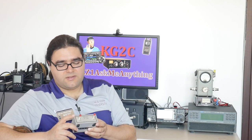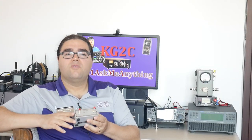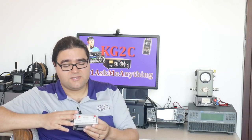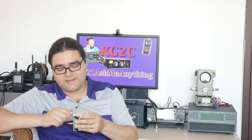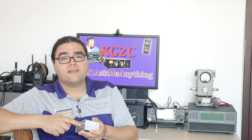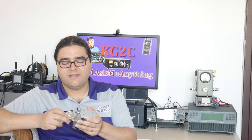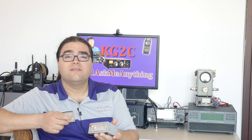One of the advantages of BNC connectors over SMA connectors is that you can use them a lot of times. SMA connectors are typically rated at 500 uses and then they break down. Now if you have expensive lab equipment like this VNA, you want to protect it as much as possible, so you don't screw coax directly to the equipment. What you do is put an adapter on the ports of your expensive equipment so they don't wear out. I have put a male to female adapter — the male side connects to the female connector on the chassis, and on the other side I have a female connector again, just like on the chassis. That way I have protected my chassis connectors from wearing out, so I can use them many more times. Once these adapters wear out, I just swap them with new adapters, and my equipment is protected.